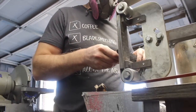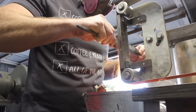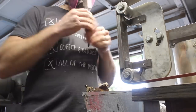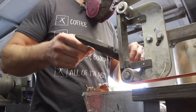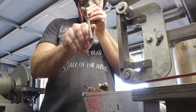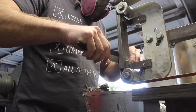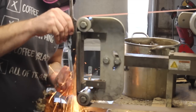Get that tempered and we're ready to start grinding. At the very tip I was grinding back where that weld line was — there was a little bit of a line where the radiuses I put in there didn't come together 100%, so just grinding back to the completed forge weld. Evening everything up, getting it consistent. Still a long ways from the finished dimensions and edge thickness. Getting everything consistent, then I can grind in my blade profile. Before grinding the bevels you kind of need to have your profile established, because you're working off the profile to determine where the center line or ridge line of the double edge blade is.